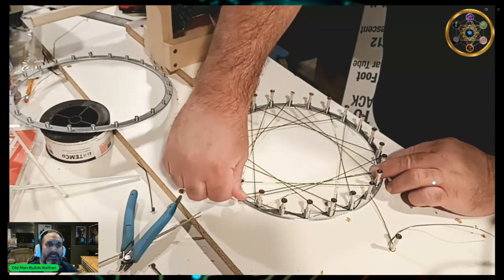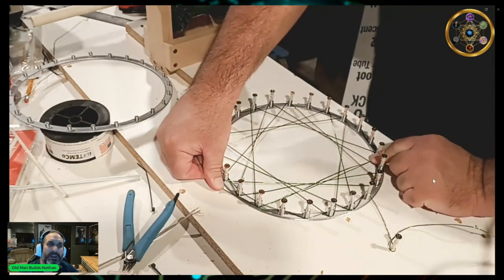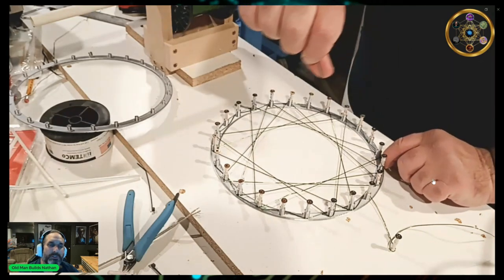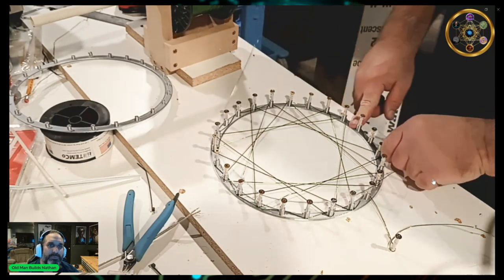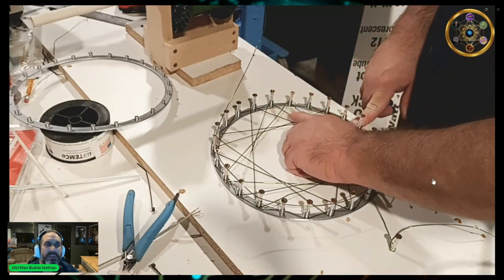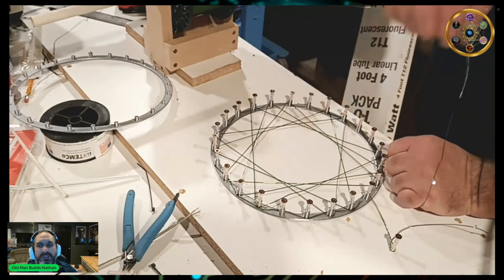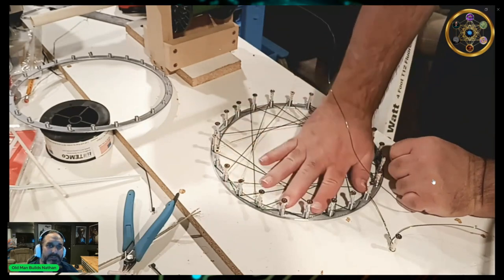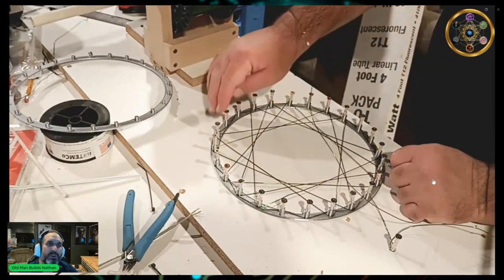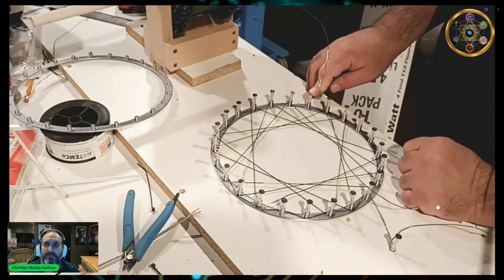And these little tabs, they always come off. You can see me right there. I know I'm not hitting the right one, and I'm looking at it. I know I've already done that wind, and I'll find it here in a minute. But one of the tricks to this is, anytime you wind triangles, you play a little game. You cannot hit the center. Anything that crosses over the center, you're out. So every time I wind, that's the way I got to think of it. But then you got to think of a triangle being the opposite, not the next in the progression. So one triangle, then the opposite, then you move one in the progression, then one triangle, then the opposite, then you move one in the progression. That's why you see me over there playing with it.